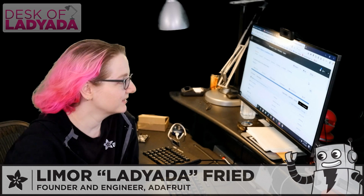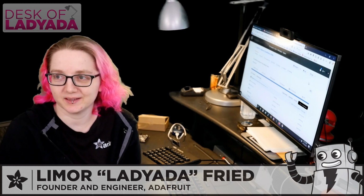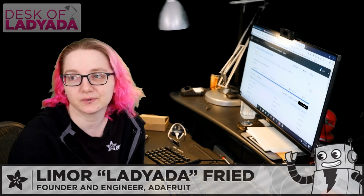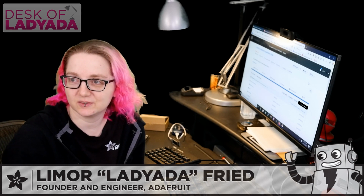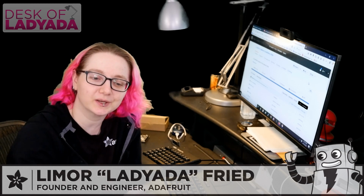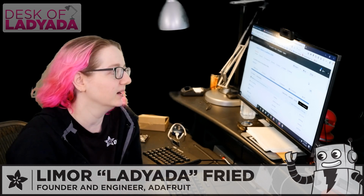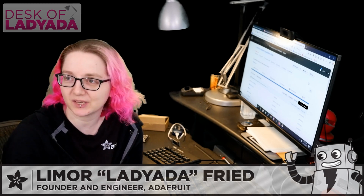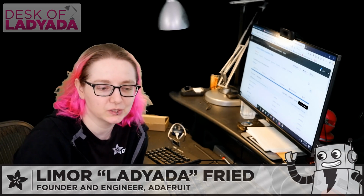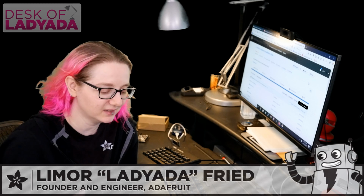So what we're doing tonight is I was just testing out Brent's new pull request to add FONA support to CircuitPython. What does that mean? That means that for our microcontroller boards that run Python, or even single board computers that run Python, you want to connect to cellular modems, send data to and from the internet using this cellular network instead of Wi-Fi or Ethernet. We now have the basics of support, so we're slowly but surely getting there. First PR just merged today, so people can check it out. We haven't added requests or MQTT support yet, but that's coming in the next week or two. But if people just wish they had raw sockets to connect to things and transfer data, you can get started right now.